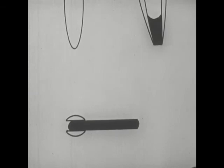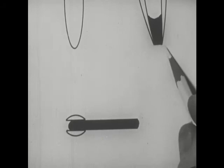The nibs of a properly sharpened ruling pen are elliptical. The space between them decreases gradually toward the tips, and the edges of the tips are sharp. When viewed from the end, no bright spots can be seen. Such a pen makes a line whose width is equal to the distance between the nibs.